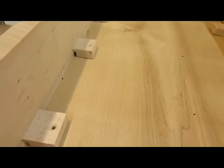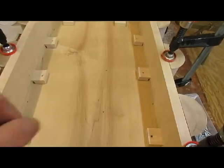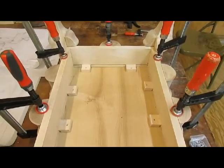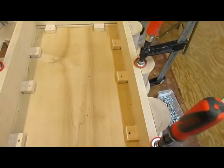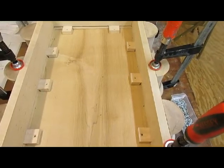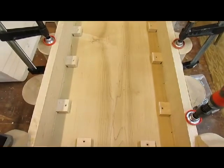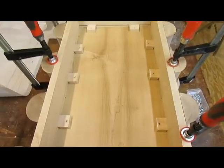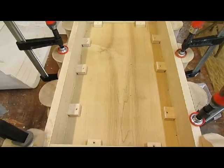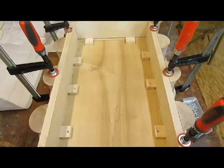all the way around, so that as the table decides to move back and forth this way, and the ends we could go all the way in because we don't expect it to move in that direction, but I've got to leave some gap between the button and the apron so that as the table expands and shrinks, it will still stay flat and tight up against the apron while allowing it to move back and forth. So I'm going to drill some holes, and I'm going to hand tighten these screws into their slots, and so I'll check back with you later.